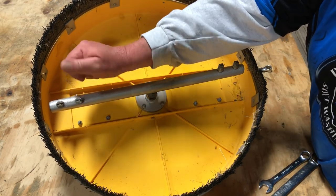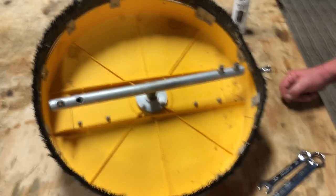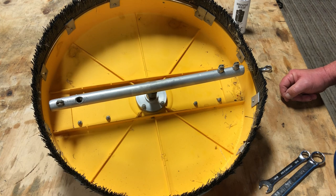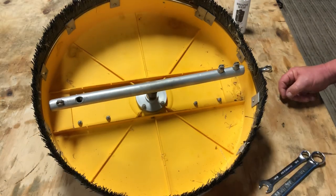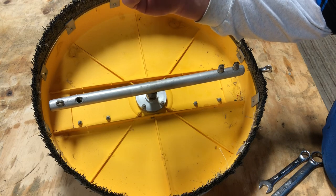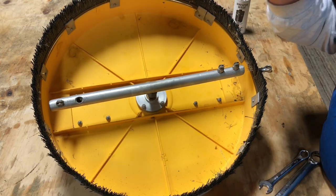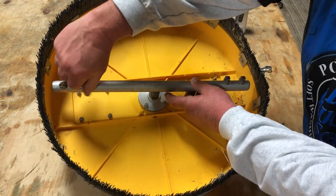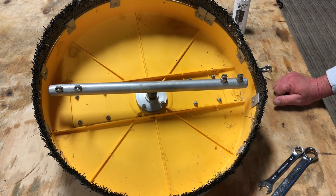So once we replace it, we take the one that's clogged and if it's fairly new and still usable, we put it into a little baggie in the truck. Once I get about 10 or 12 of them, I'll spend time at the shop in my spare time and unclog them all using a welder's tip cleaner that you can get at Lowe's or Home Depot. We also use our dental pick set that we use for removing O-rings. Sometimes you can get the little piece of sand out of there — get the piece of grit that's clogging it released, blow through it a couple times, make sure it's all the way out, blow through from both ends, and then get it back in. Make sure you line up your little ridge so it works properly.